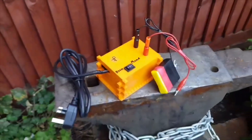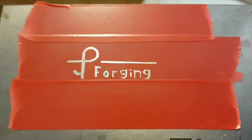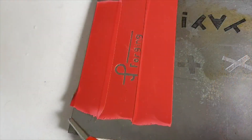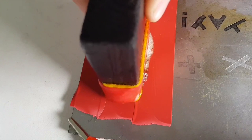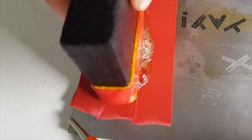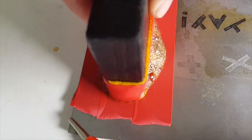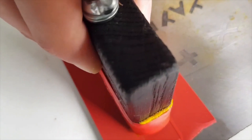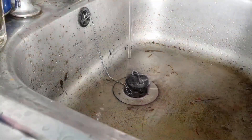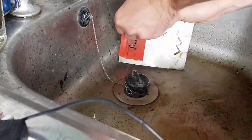Now let's give this a test. For the finale of this project, I made a little template just using electrical tape and an exacto knife — not easy, but we got there. We're going to dampen the applicator and see if we can give this a good etch and a good mark. I found that using three 10-second bursts with the applicator seemed to create a pretty good etch. It seems to be burning in the design pretty nicely. Then, after three 10-second bursts of etching, I did exactly the same thing whilst marking, flicking the switch over to mark — three more 10-second bursts using exactly the same method. After finishing, we gave it a good rinse under the tap to get rid of all of the excess crud, then took off the electrical tape to see how the design came out.